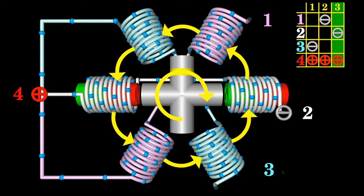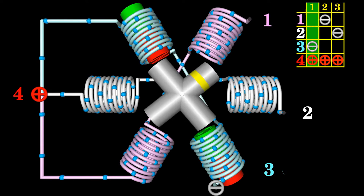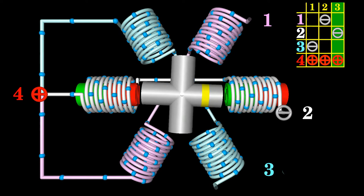As you can see, the rotor spins clockwise even while the electromagnets are enabled counterclockwise. Besides the command sequence, the rotational direction of a stepper motor depends on the number of teeth at the rotor. In full step mode, one out of three phases is on during operation — 33% of the electromagnets move the rotor. Remember that 50% of the electromagnets were used in the bipolar stepper motor in full step mode. The rotor is said to have four poles even if soft iron is essentially not magnetized; however, as soon as a phase is energized, magnetic poles are formed at the ends of the rotor.